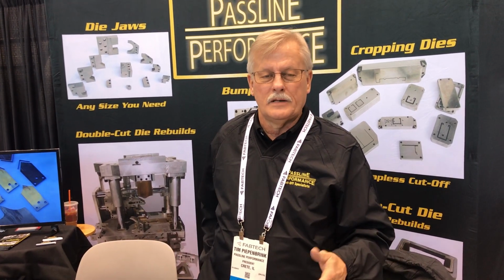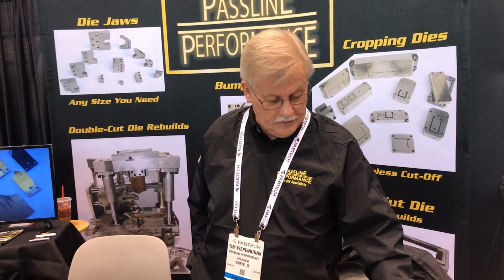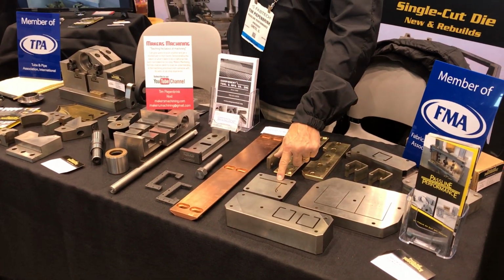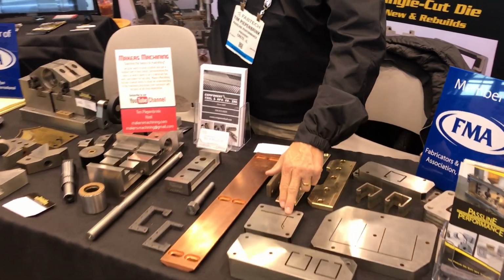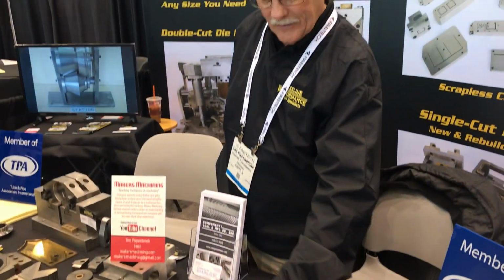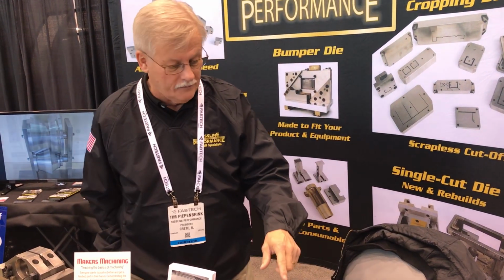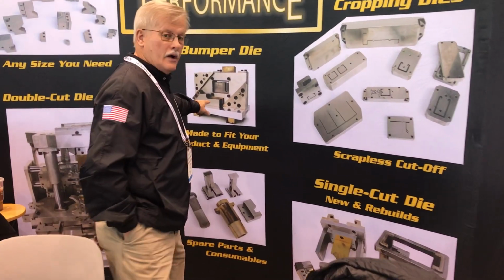If you go buy pieces of pipe or edging or whatever you buy, you can get it all the same length. But these blocks here are for various shaped parts. This is a drip edge for a roof that goes after the shingles into the gutter. That helps the water get into the gutter from the roof. So people make that out of thin material, and as the product is made to this shape, it's a non-stop long strip of material, that shape, then it will go through a die that cuts them off. And the die that cuts that particular piece off is this right here.